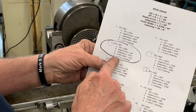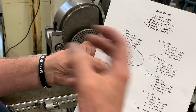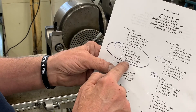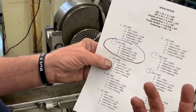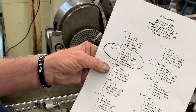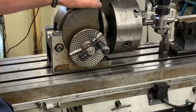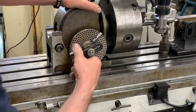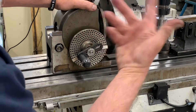I need a rotation of 1 rotation and 7 thirteenths. I don't have a 13-hole plate or 26-hole plate, but I have 39 because 3 times 13 is 39 and 3 times 7 is 21. So I'm going 1 and 21 thirty-nineths — one full rotation plus 21 spaces every single time I make a cut. I rotate, make a cut, come back, rotate again.